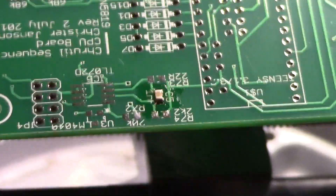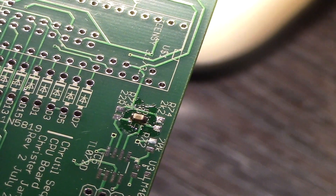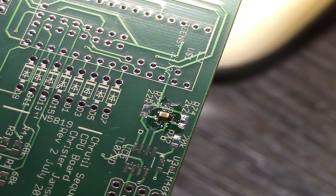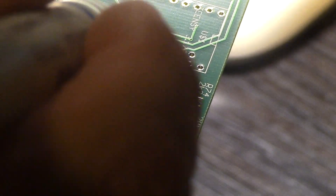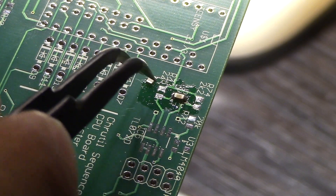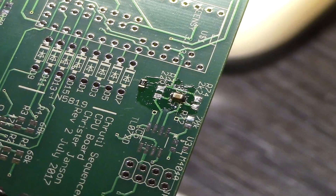Let's see if we can get some focus on this — maybe that's too bright. Anyway, just for fun I'm going to do one more. I'm going to pick a resistor this time, dabbing a bit of flux. It's a 22 ohm resistor. Before I attach it I like to have it up so I can see — it says 220, which is of course 22 ohm with no zeros.